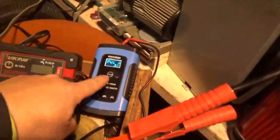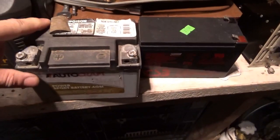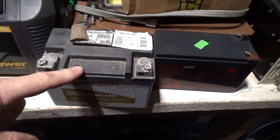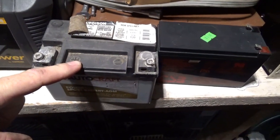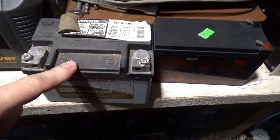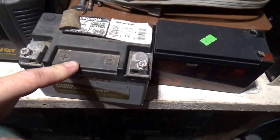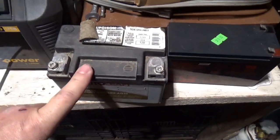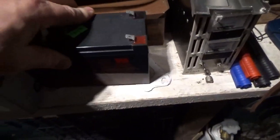I've used this meter to test a bunch of batteries and used the charger on pulse mode. I hooked it up to a stone-cold dead ATV/motorcycle battery for several days — close to a week — and it went from 0.8 volts up to about 5.5 volts, but it produced no power and no cold cranking amps. Put a light bulb across it and it goes right back to zero. I could not recover that battery.